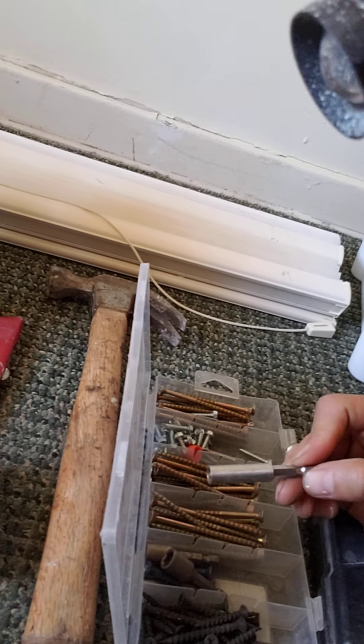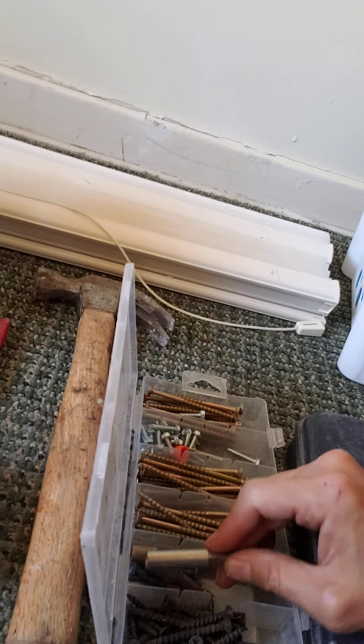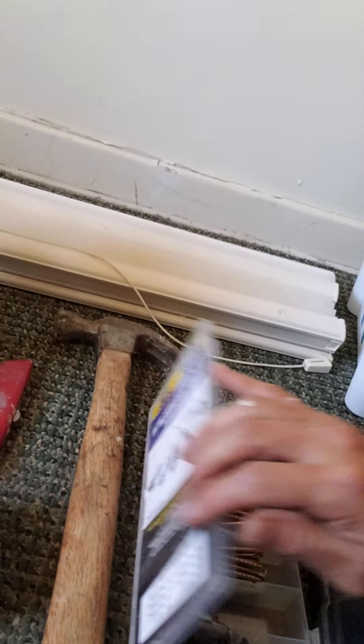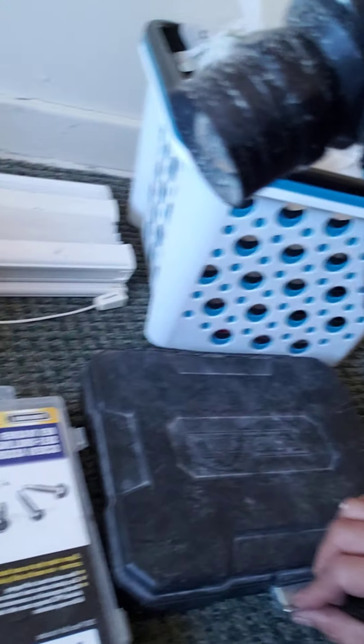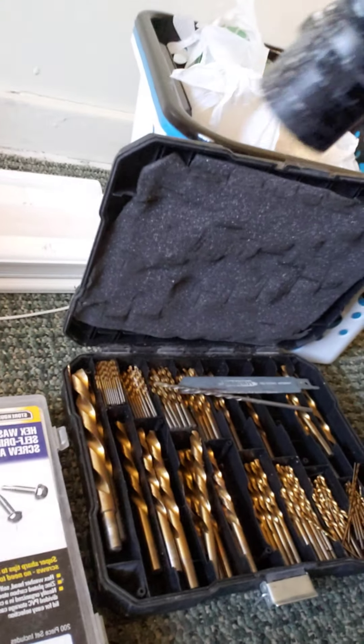It's also good to get drill bits that are magnetic at the tip — more expensive, but they save a lot of time. For example, I was not using self-drilling sheet metal screws before, and it took me a whole day to do ductwork for my HVAC. Now that I use these self-drilling screws, I can get that same job done in about an hour. So what was an eight to ten hour job becomes a half-hour to one-hour job — about ten times the time savings.